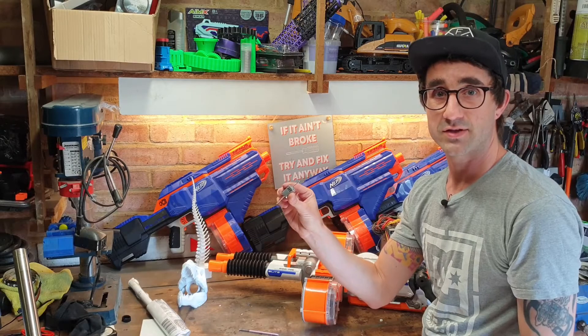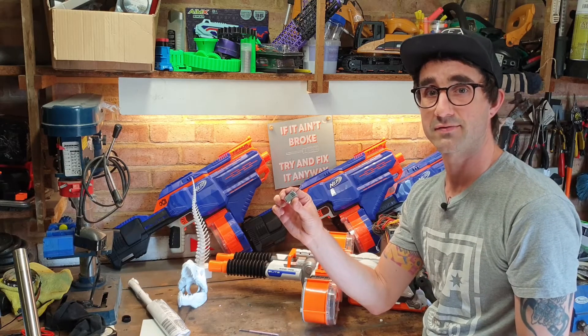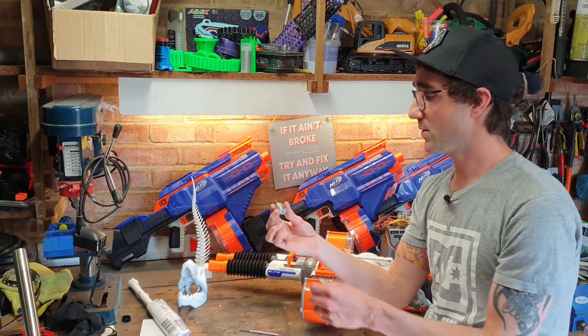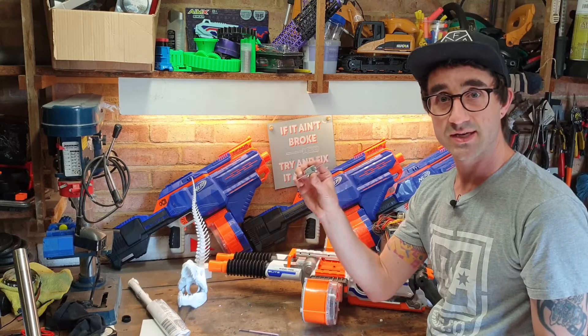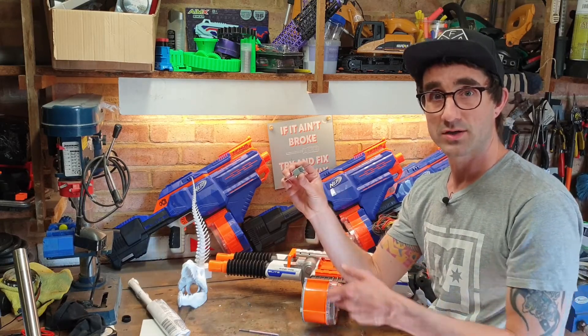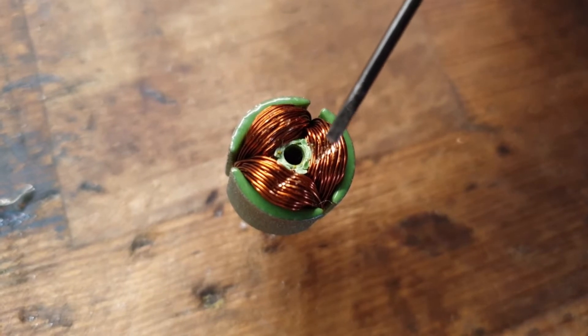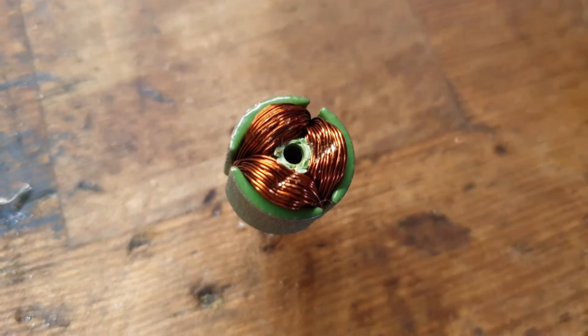However, if I'm going to do this for a second one I'll have to be more gentle. I have various bits here that I can probably use to manufacture something akin to a pinion press or puller, like you'd use on slot cars. So I'll do that to make sure the next one is better treated, because this one did suffer — the windings got marked by pliers and other things I levered on it with. Because it's insulated wire I worried the coating would be scratched off and it would short out — thankfully not, but it does look a bit unhappy.